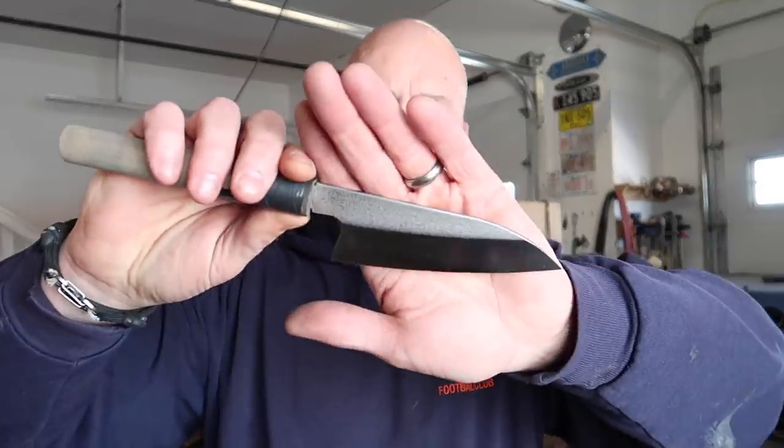Something I'm going to do for this project - I've tried it once yesterday - is I'm going to be grinding a 36 inch hollow radius onto the knife. This different knife here is what the project is based off of, and it's actually ground in with a radius platen from Bill Bankey. He makes those really great file guides that everybody loves and he also makes a radius platen. Instead of a flat platen, it's got a 36 inch radius, giving you a really nice gradual hollow grind. I think that follows very similarly to the way traditional Japanese knives are ground - they don't actually do a flat grind.